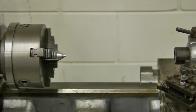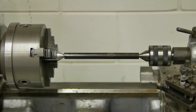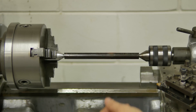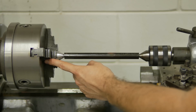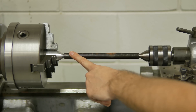That's where machining between centers comes in. With this process, you mount the work between two tapered cones. This ensures the work is concentric and supported on both sides, which makes it perfect for machining things like drive shafts. It also allows you to remove the work, test fit, and mount the work back in the lathe and have it be in the exact same spot. Now, there is one major problem with this setup — how do you transfer the power of the lathe to the workpiece? You might think there's enough friction between the cone and the work, but there really isn't. That's where this thing called a lathe dog comes in. It's a simple device that clamps onto your work with a set screw and has a leg that sticks out and gets pushed by the chuck. Okay, that was way too much explaining, so let's just start building something.